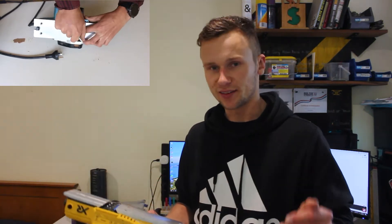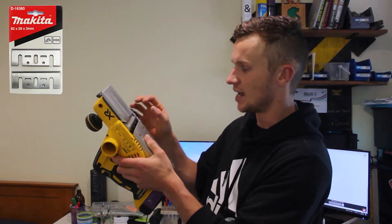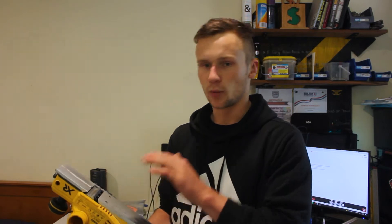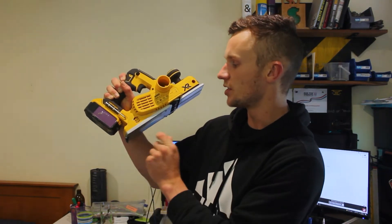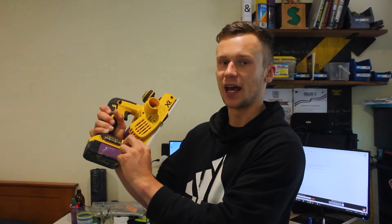I have done a video on how to change the planer blades — not for this planer, a Makita one — but the process is exactly the same, so I'll link the video in the description. I do have some planer blades by Makita and these are thicker in size as you can see, opposed to the small little ones you usually get. I use these when I'm straightening walls because if I'm going to hit a nail or rough timber, these planer blades are stronger and won't break as easy. If I'm doing something more detailed like planing a door or an architrave, I'll use the typical planer blades. The good thing about those small planer blades is they fit right in here, which is a little storage area to keep some spare planer blades — super handy to have on site. Next to it we have an Allen key which comes out and we can use that to reset and change blades over.